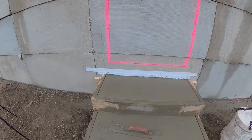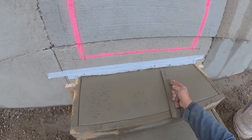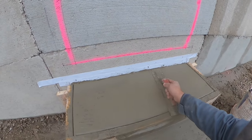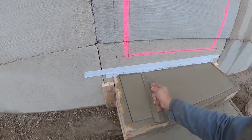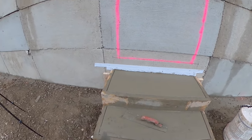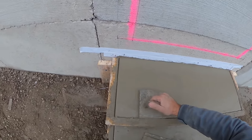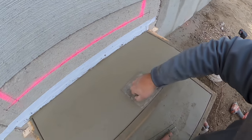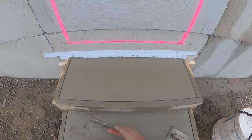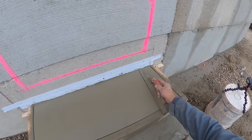The first step is to finish the top surface - we'll re-edge everything and give the top its final finish. I'll mag this out and make really sure it's tight up against that wall with no voids at all. Then take the edger and run it for the last time to clean up that top edge one more time. Get this side too, then mag off the top one last time. Now we're ready to pull the face board.